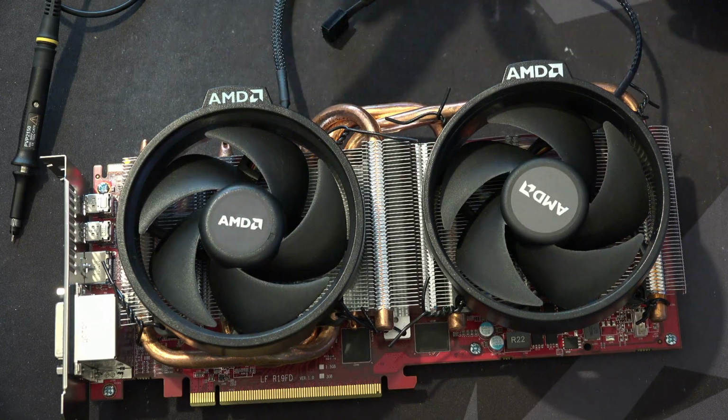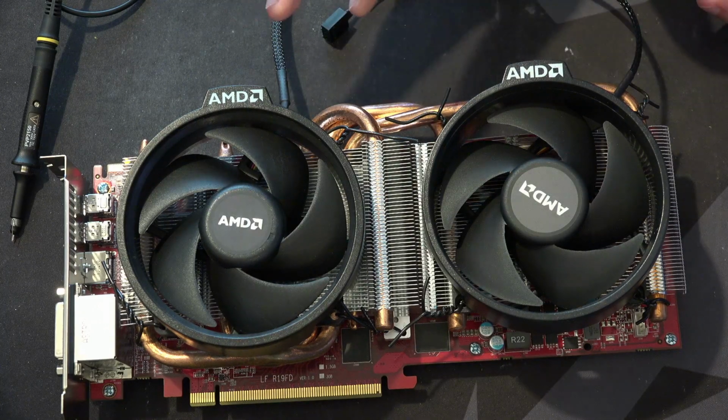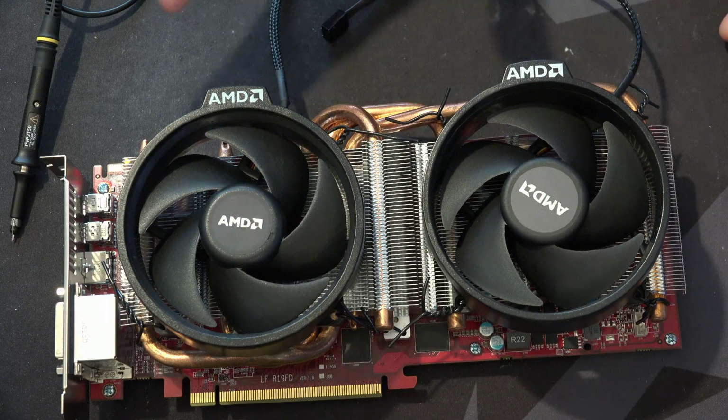But with NVIDIA ones, I've definitely run into that where you add a couple capacitors and bam, 100 megahertz more memory clock or whatever. I think I had one card which picked up like 300 megahertz, but that might have been a testing anomaly. It was also single phase memory power, so that might have had something to do with it. Anyway, the caps can help with memory overclocking,